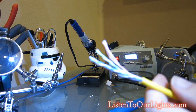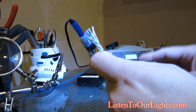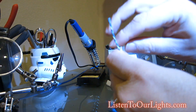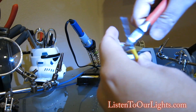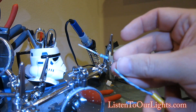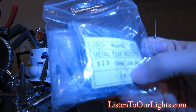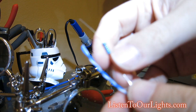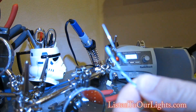I'm gonna be terminating a Light-O-Rama RS-485 network, which means I'm gonna be looking at pins four and five, which are the blue pair. So I'm just gonna take all the other ones aside. Here's the 120 ohm resistor. As you can see I have a couple spares. This is 120 ohms half watt. What I want to do is basically wire up this resistor between these two wires.